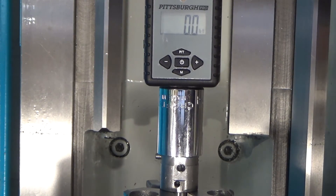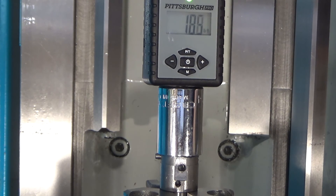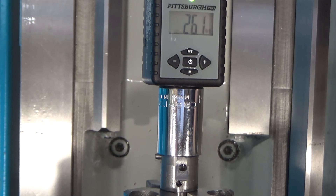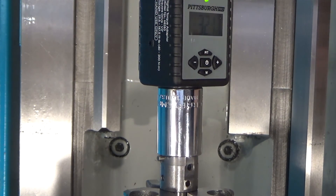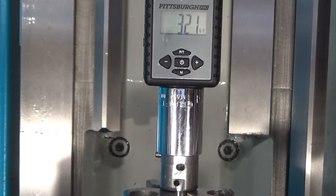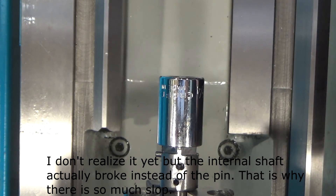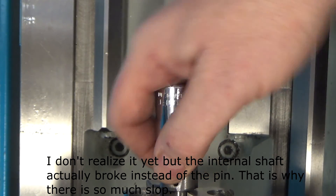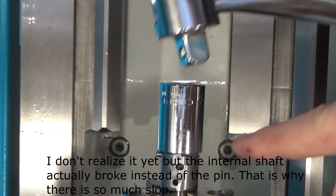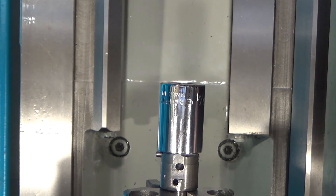Now the hardened steel pin — this one fails catastrophically, so I have to use the foot brake on the lathe. 15... 17... 20... 22... 23... 26... 27... 28... 29... 30 — there it is: 32.1 foot-pounds. All of these results were somewhat lower than the double shear strength, probably closer to half. I think the issue is there was too much slop between the shaft and the outer part in my test fixture, causing it to cant and fail closer to single shear mode.